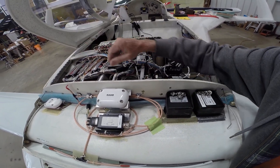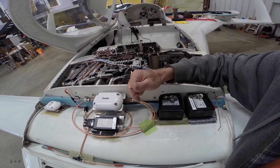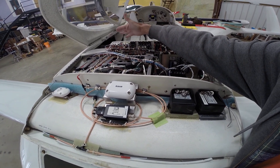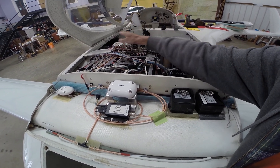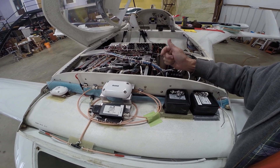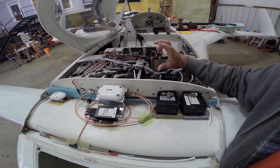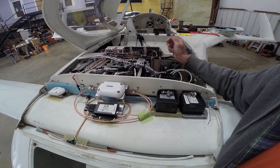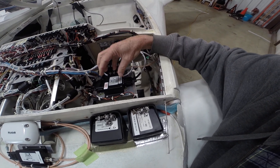In here I've got a Vertical Power unit for non-critical electronics and avionics — they break out into thermal strip circuits. I could easily replace the Vertical Power with discrete fuses if necessary. All the essential flight avionics are powered through discrete breakers. I'm using the Bob Nuckolls Z101 configuration — look at his AeroElectric Connection book; he's got the Z101 posted online.